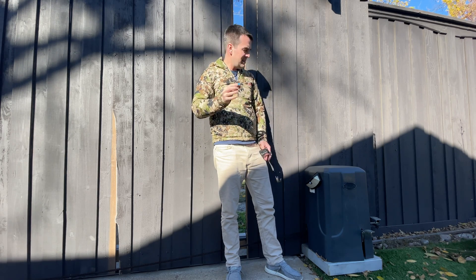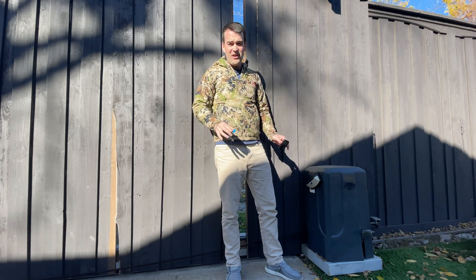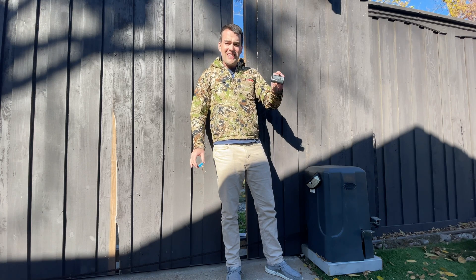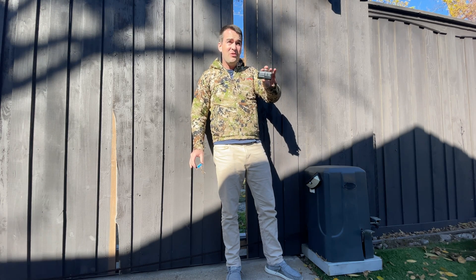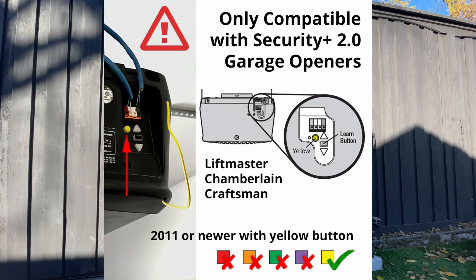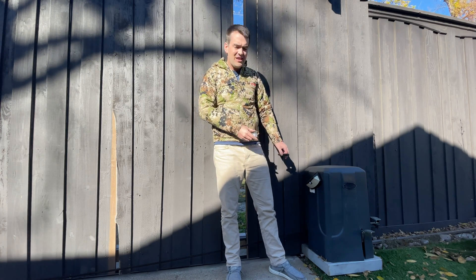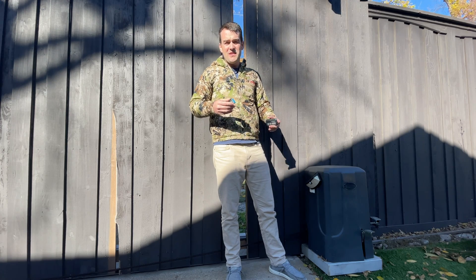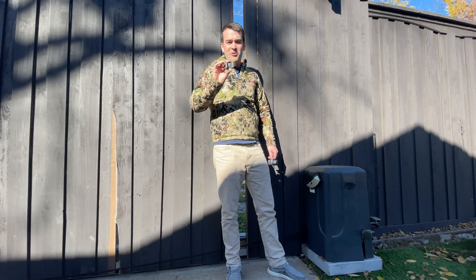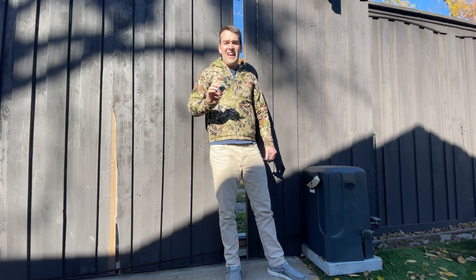I'm going to explain why I bought this for this Ramset gate. This is not meant to be for Ramset. Ramset is not affiliated with LiftMaster Chamberlain group, but it did have a LiftMaster clicker that I use for all my other devices with a LiftMaster radio module that has a yellow learn button. So I thought I needed this until I dug in deeper and realized I didn't. I tried to use a Shelly, and the Shelly could open and close it, but it was not getting good readings on the built-in limit switches because of a voltage difference. I ended up keeping the Rage Against the Garage Door Opener because it works great — it uses the built-in limit switches, great connectivity, and I already had it.